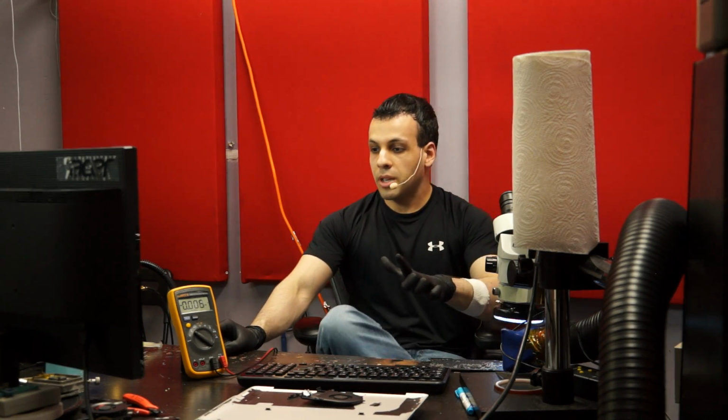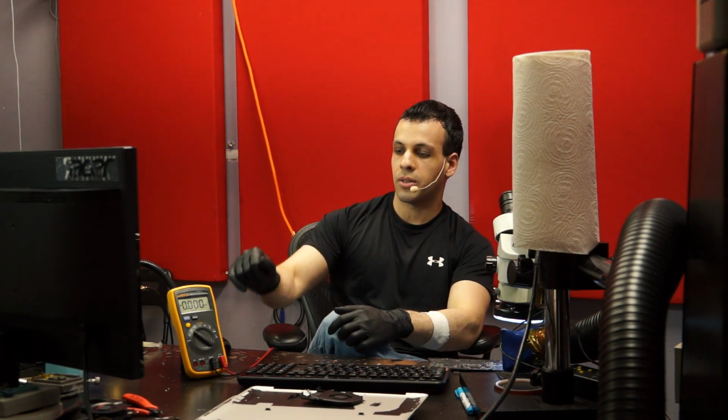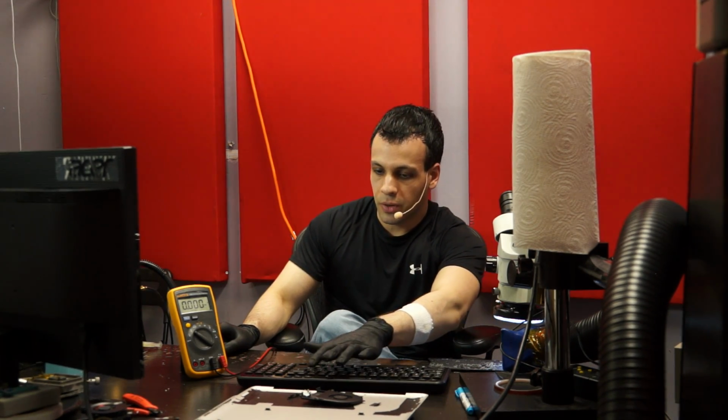Now, most of the time, people would be adept to blame the SMC. They would say that the SMC is bad because everything here is present. But what I want you to think about is what is going to actually turn the SMC on. So let's go over an older schematic where this may make some more sense. Let's go over to the first page of an older schematic.